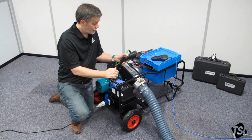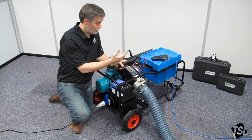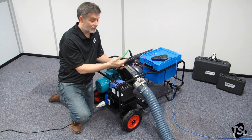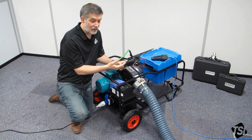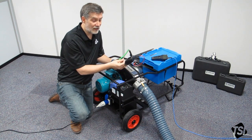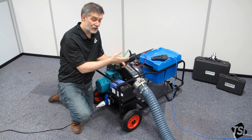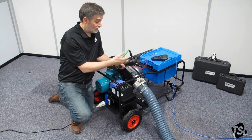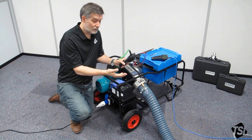This is now going to run for five minutes, so we're going to start it — it's now testing. These values will pass; I can see they're below the leak limit. At the end of the test we'll get a pass or fail — hopefully in most cases it'll pass. If you get X's instead of values for the leak factor and leak rate, that means it's gone under range. That doesn't mean the test has failed; it just means the leakage rate is lower than the Panda can measure using the flow grid. You would then need to use the low flow nozzle and switch over to that to measure the lower flows. Once the test is finished, you can save the data and load it into a spreadsheet to manipulate it from there.